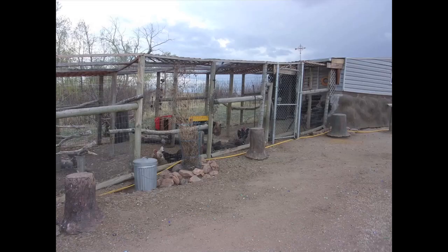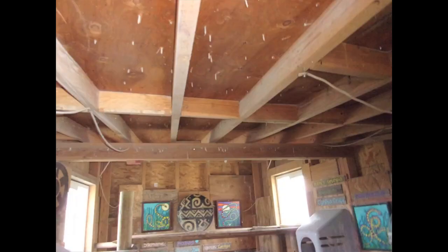My wife had assumed that the roof would be angled to the back of the structure, but I decided to angle it to the front because of drainage issues. You see, our land is sloped downward from the back of the structure to the front. The roof structure is fairly basic, using 16-inch centers and 2x4 construction with plywood, roofing paper, and asphalt shingles on top of that.